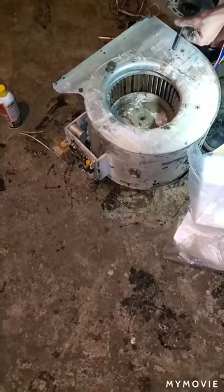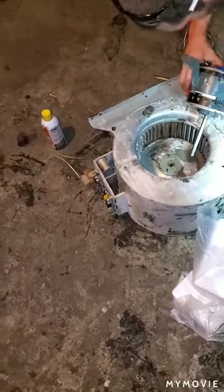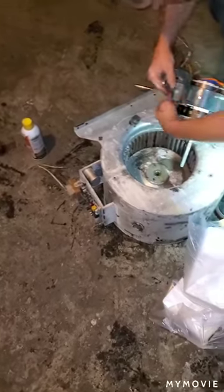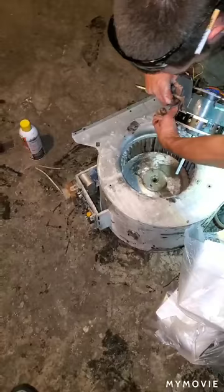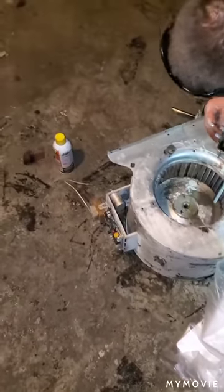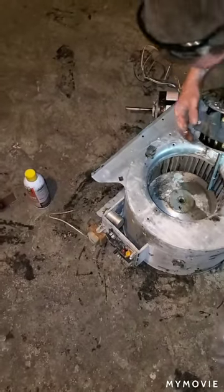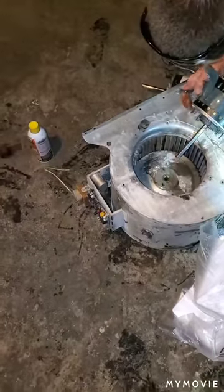Tighten that band up first on the motor. Yeah. You don't want that going in too far because you gotta adjust the squirrel cage. Where was the band located on the old motor? More towards the shaft, wasn't it? Dead center. Dead center, okay.